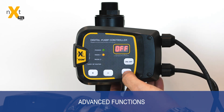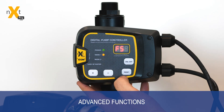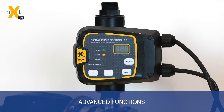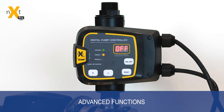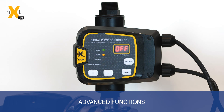The controller also comes with frequent start protection. Go into the menu and scroll down to the last menu item for frequent starts. By setting frequent starts — one being enabled and zero being disabled — the controller will monitor the system and detect how many starts the pump has, and if there are too many, it will shut it down to protect the motor. When that occurs, the screen will display FS to show that alarm. Another common error message is OP, standing for over pressure — when the system has more than nine bar of pressure running through it, the controller will shut down to protect it.